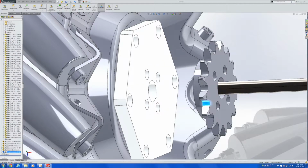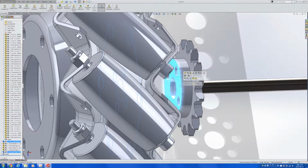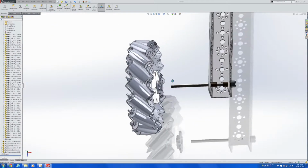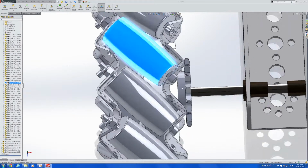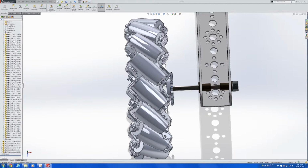So when we're adding a sprocket, we could just make these sides coincident and just bolt it in. It may not seem like a problem until you look at it on this side. If you put in your sprocket like that, it's very likely for the chains to get stuck onto the wheel because chains have width. And what this shows is that if we are to put a sprocket, there has to be something else in between the FTC conversion plate and the sprocket.